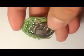Alright guys, I already cut those little spot welds over here. What I did was simply slide the knife under the metal part and push it upwards, and that breaks those little dots. Now the top part is already off, it's already apart, you can see that. But now there is another one on the bottom. Once you cut the lower part, the battery just comes off.